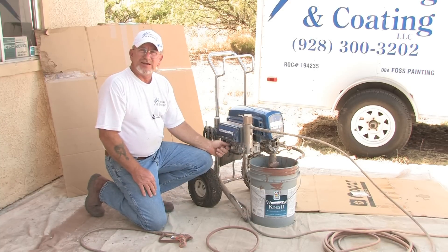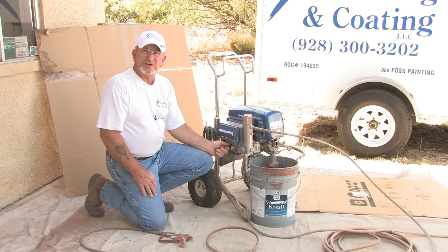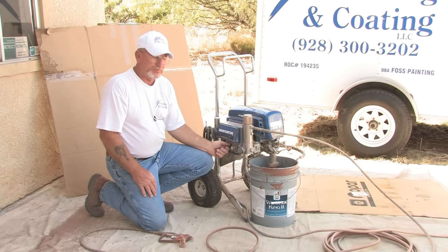This airless has a smart switch so that when you're pumping paint, if it gets too low it'll shut itself off so you're not sucking air. Because once you start sucking air in your airless, you're going to lose pressure and your spray is going to finger on you.